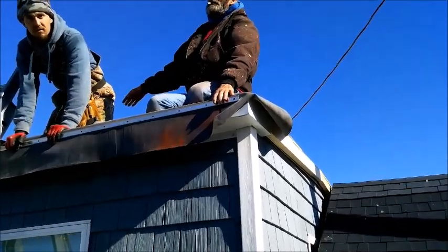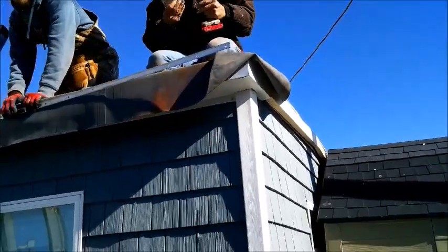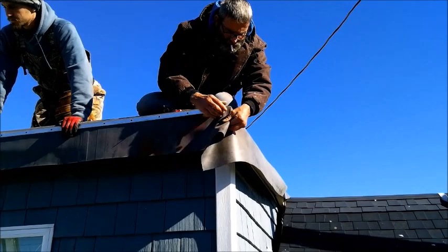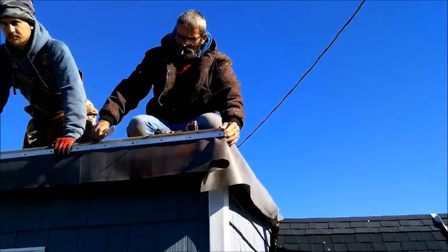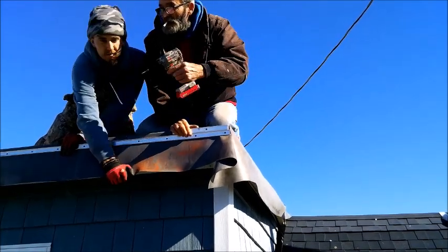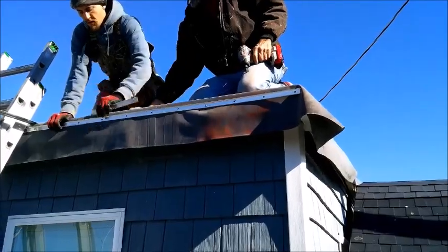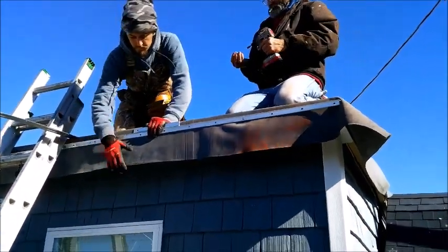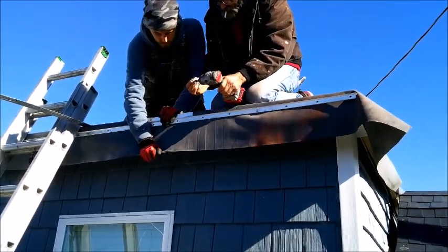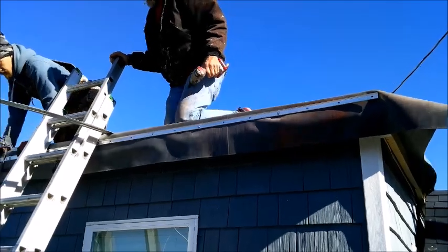You have to pull on it. Use your gauge. Corner to the edge. Use your gauge. Another piece of termination bar on the top. Flush the plywood down. Pull the rubber tight. That hem was 73, right? 72. Yeah. This gauge block all the way down keeps it straight. Pull that rubber nice and tight. Once you get that on that rubber, never go.